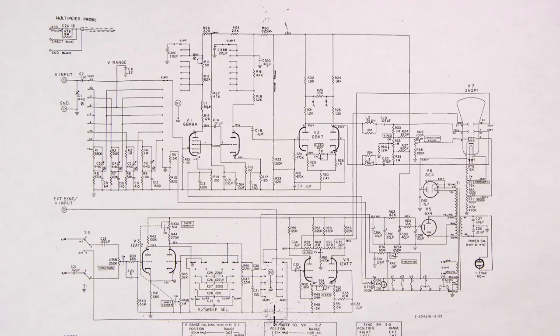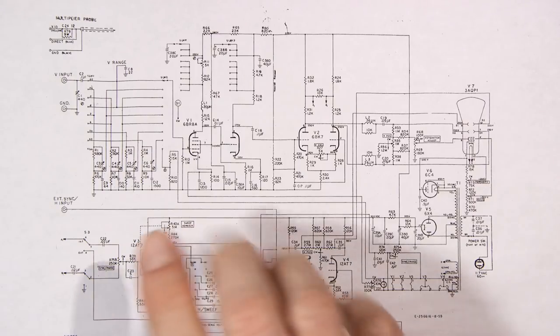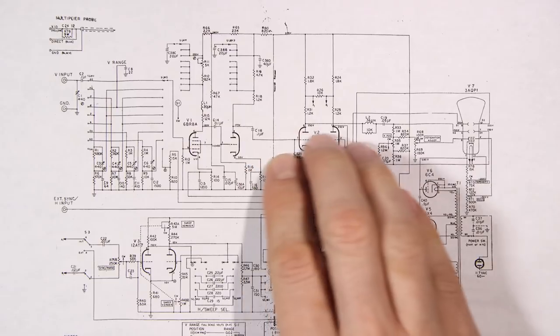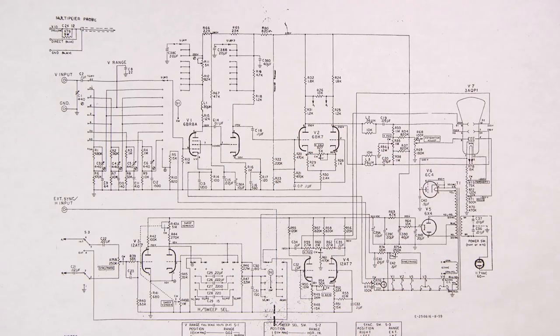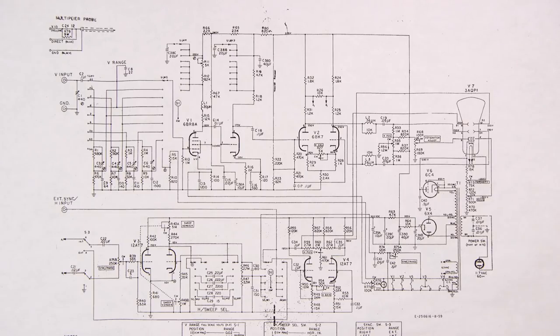And it takes quite a bit of design to make an amplifier section do that, to make it that incredibly broadbanded and work within parameters inside of the oscilloscope. Now, this is a much lower frequency oscilloscope. This is pretty old, so this doesn't go much beyond the audio region. But still, this does deal with a little bit of RF, and it's capable of amplifying that as well.